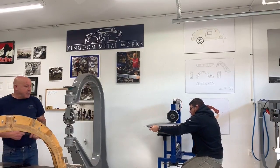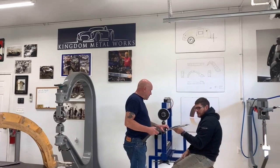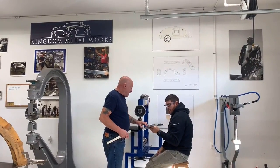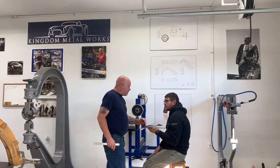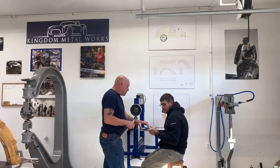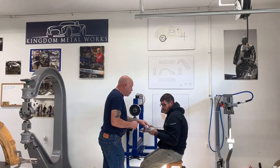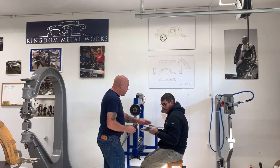Let's just put the shape in there, Jeff. So you're getting more and more shape coming in through this area. Now we're going to have to determine, do you need any more shape on the lower section? So we're shaping up this area. As we're shaping up this area, once again, the panel is becoming more stretched, which is putting more pressure onto this, which will make this panel go like this.